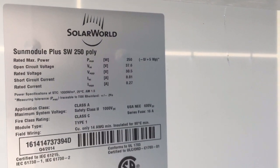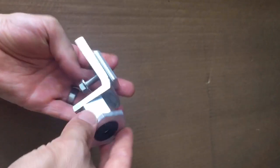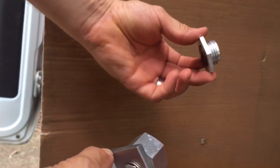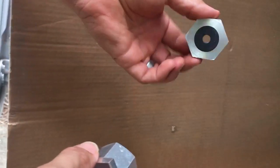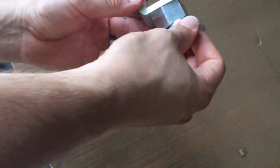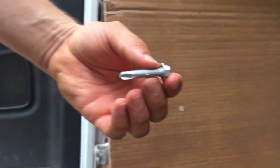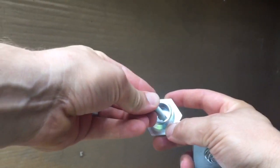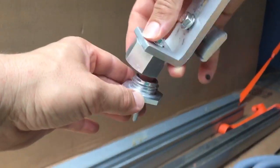Watch out folks, we're doing the big solar today — solar farm quality! Here's that metal roof base that we just installed. They have a threaded base with an EPDM-backed gasket that goes down onto the metal. On the metal it works like this: just a giant self-tapper, like a quarter inch — you just go down through there. Run your self-tapper down through the hole and then it goes into the metal, and the base goes on top.